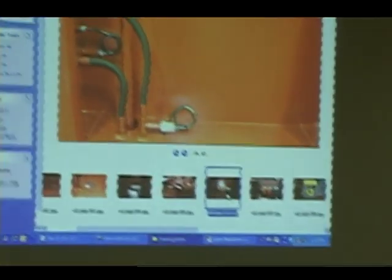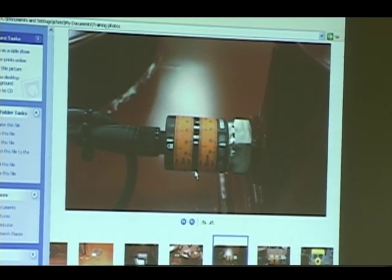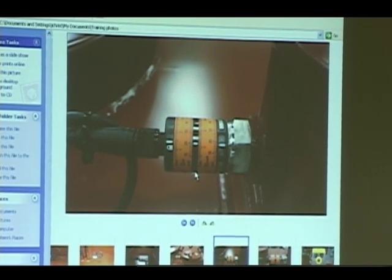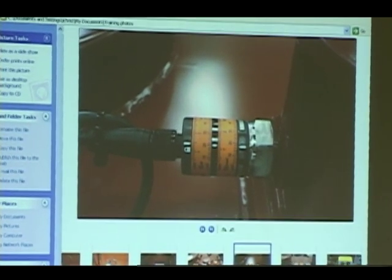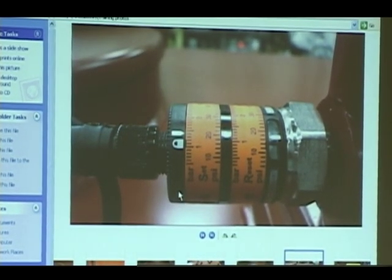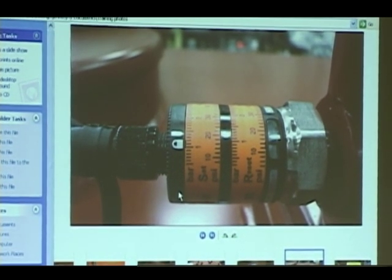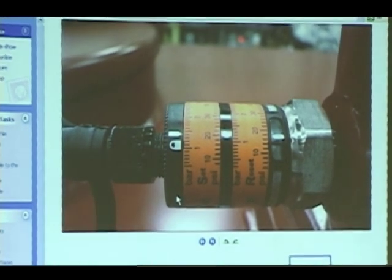These are the new pressure switches compared to your old style that you had before. And it's got a trip setting and a reset setting on there. They're pretty much tied together. They're about 100 psi, give or take, between the two, on the pipeline pressure, high hydraulic oil pressure. So say it trips at 2,000 psi, the switch itself won't reset until it's at 1,900 psi.